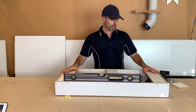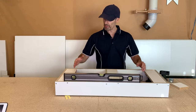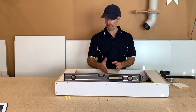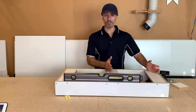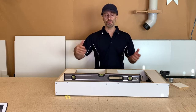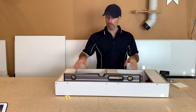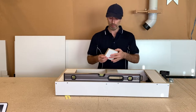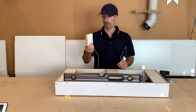You can really level this thing quickly. As you can see, I've got divisions in this particular plinth — this one takes two cabinets. You can make these longer or join them together, just depending on how long the run is. If it's also got stone tops with a lot of weight, you want this to be quite sturdy and strong.